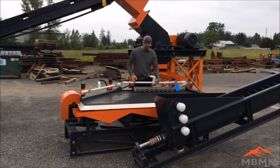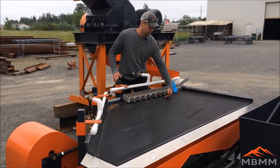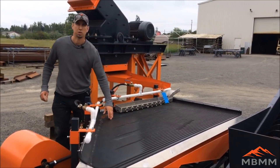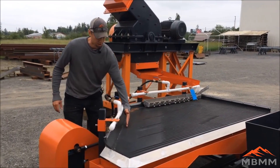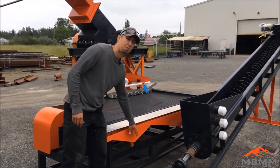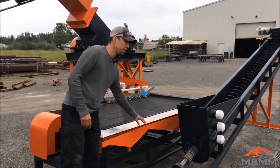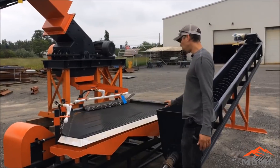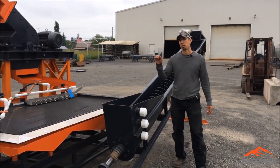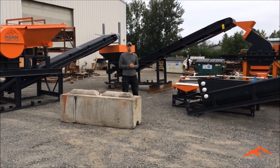The slurry comes down into this distributor trough. The white water bars here flow water down onto the shaker table. The material comes down over these grooves — the gold and heavy material gets caught in the grooves. The shaker table brings the gold, sulfides, silver, whatever you're trying to concentrate, down onto the cleaning plane and into number one and number two concentrates. There's a number three concentrates bin where most of your sulfides are going to go, with a splitter you can adjust for the cutoff between number three middlings and number four tailings. The tailings flow down into this spiral classifier where the heavy material, the larger pieces, settle down through the basin and get augered and dewatered. So I hope you guys enjoyed the video of our two ton per hour walkthrough.